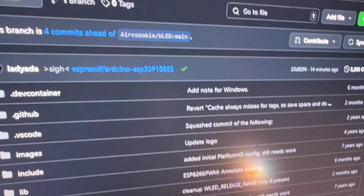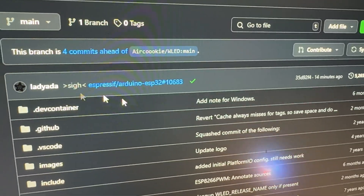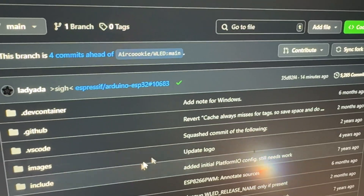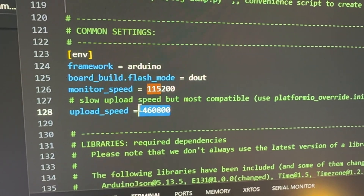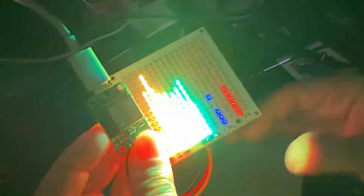So what I had to do is fork WLED. I even bumped into a bug. But I got this working by forking, making the change, and compiling it all in Platform.io. Did a couple of uploads — maybe a little faster upload — but got it uploading and working. Now I can verify that the i2S microphone works.